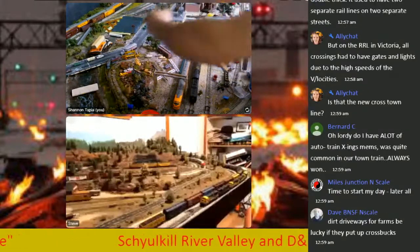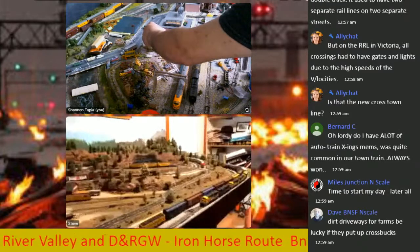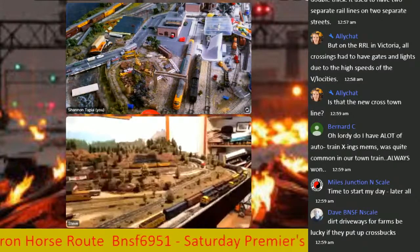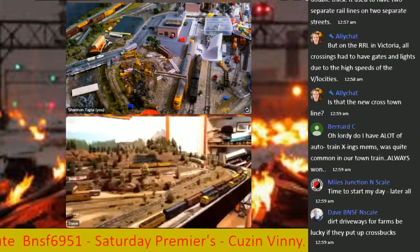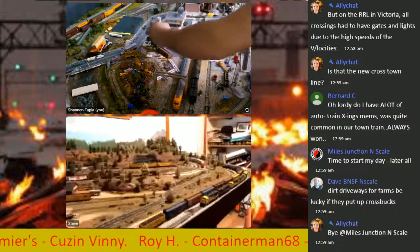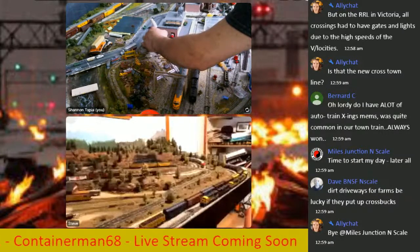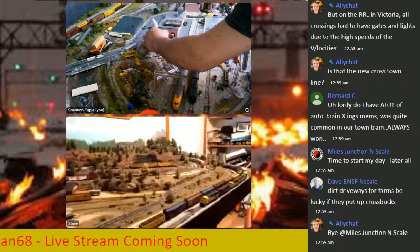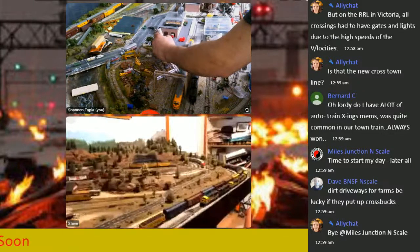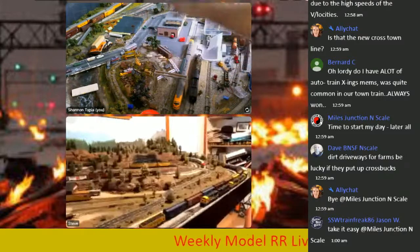The helpers would stay in whatever mode they were in when they lost continuity from the head end. So if you're under throttle, they'll be constantly throttling up and up and up. And it won't be until the engineer figures out that it's getting pushed instead of in control. Now the head end is going downhill, the rear end is shoving, but it lost continuity, so it goes over the hill and now it's shoving downhill. It worked, but with the DPU technology they've got now, it's rock solid reliable.